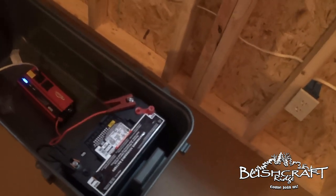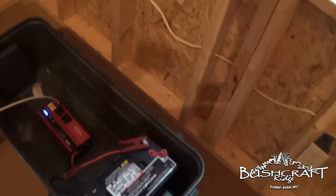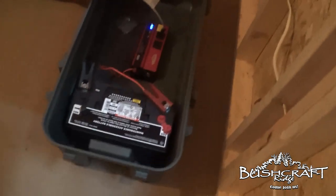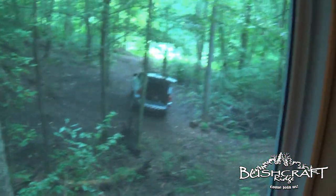This is just the beginning of my battery bank. Eventually I'll have four of these batteries — two wired in series and two in parallel — to make it 24 volts and double the amp hours to 210. I'm about to do some more insulation work in here. Let me know what you think, questions and comments below, and we'll see you on the ridge.